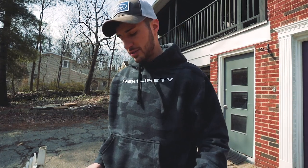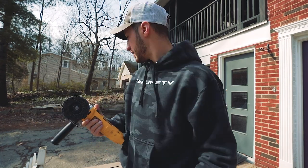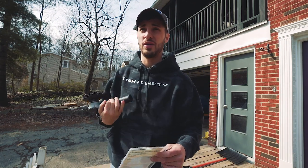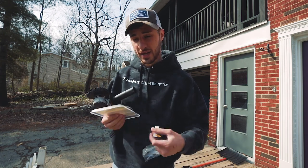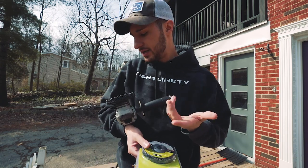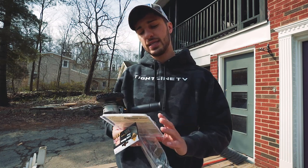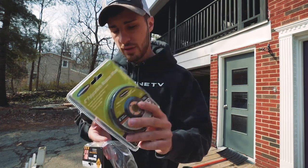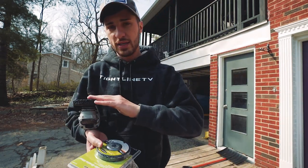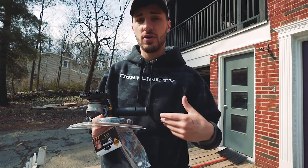We are back from Harbor Freight. I picked up a grinder — I'm going to use this to get all the old paint and rust off the trailer. The trailer is in good shape overall, but the paint and rust aren't great. Hopefully we don't find any underlying issues when I take the paint off. The wheel I'm using is a polycarbide abrasive wheel, specifically made for removing rust, paint, and flaky material. Make sure you get the correct one — you can actually damage the trailer if you do this wrong.